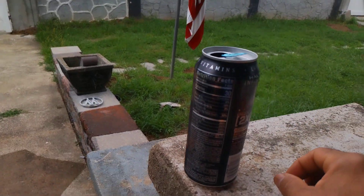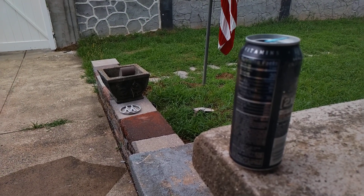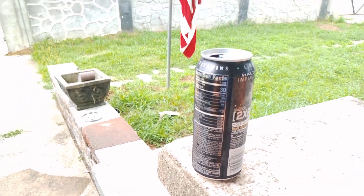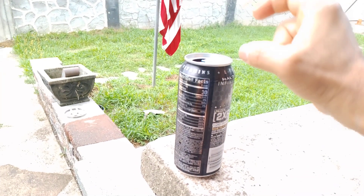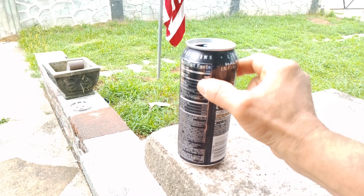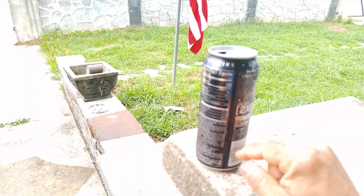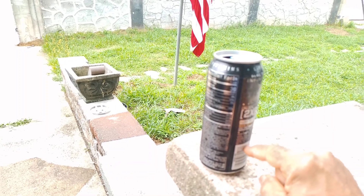What does it have to do with anything? Let's talk about collapsing structures and exoskeleton, if you will. I'd like you to think about the construction of this can being round, and then you can change it to any form you want. Now imagine that if you could put floors connecting inside this can at any location, say 10-foot or 8-foot-high ceilings, and you secure it to the can. You secure it based on what you think the loads are going to be — the dead loads and the live loads — the live loads being 40, 50 pounds, even 100 pounds per square foot.